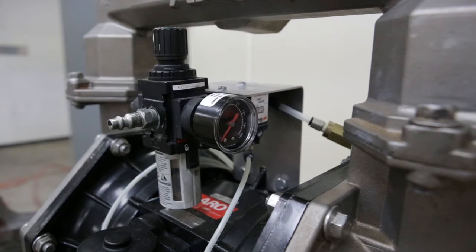When the pump starts, the diaphragm and diaphragm plate might come against a solid wall of powder that's in the cap. A couple things may happen. The pump will not run at that point, or, if there's enough force, you can actually bend the diaphragm plates or the bolt that's holding the diaphragm onto the connecting rod. There have been instances where 3/4-inch bolts were bent or broken off.